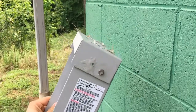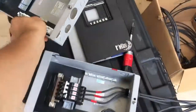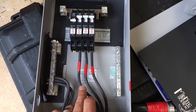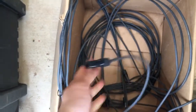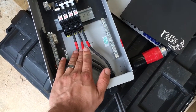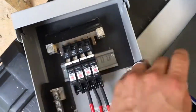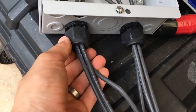Be careful when you're mounting stuff underneath solar panels — you're creating a habitat for squirrels. This is a combiner box I'm repurposing from a job, and I'm sending it to one of my customers. Each one of your solar circuits comes in right there. These female connectors hook onto the positive of the panel, go into the breaker for overcurrent protection, then bite onto the bus bar, and the power goes out to the charge controller.